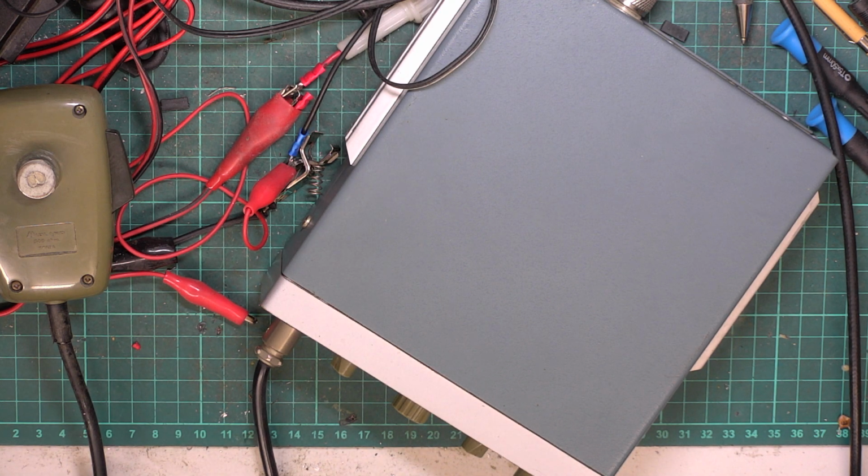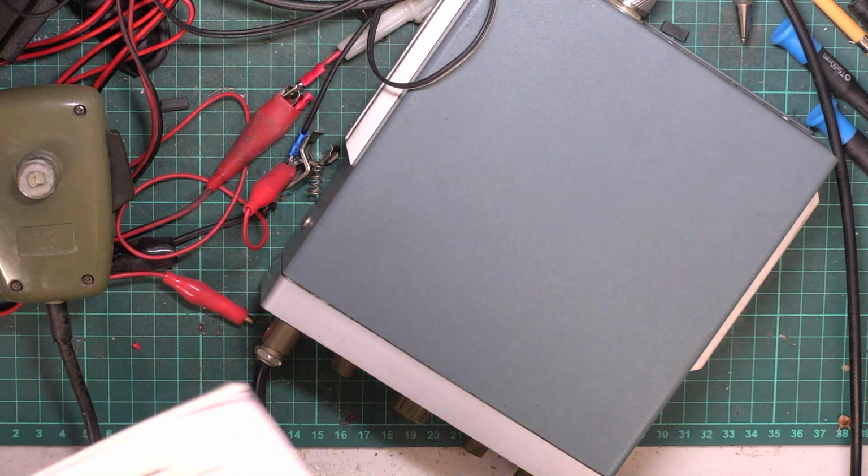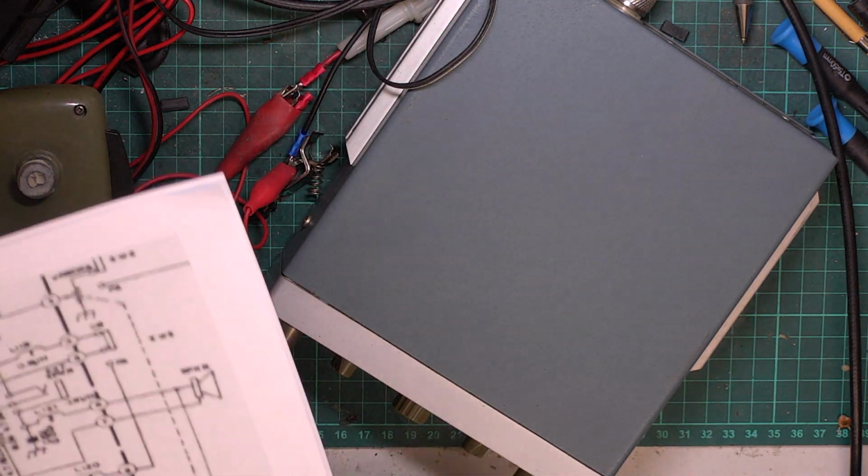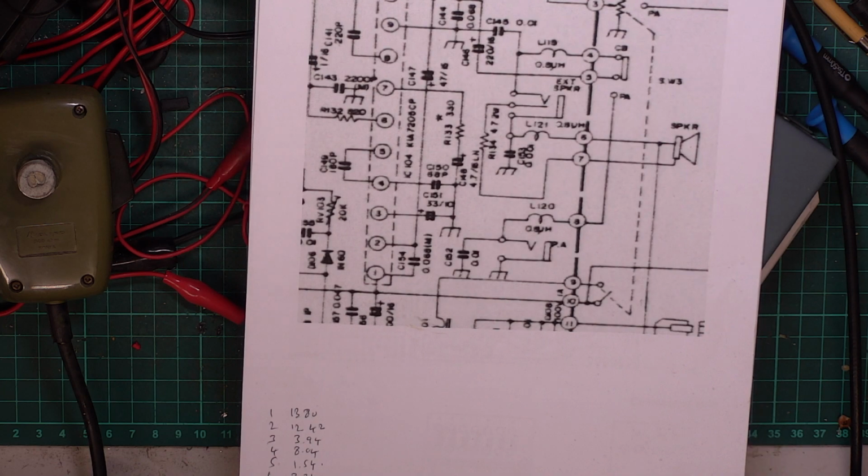So, winding forwards to the next day, and it's actually led us on a merry song and dance, this radio. But it's finished and we've got the volume we want. I went on to the other test set, and it's supposed to be 2 watts output, and it was only 1 watt. And it just was not loud enough. And the PA was not loud enough.